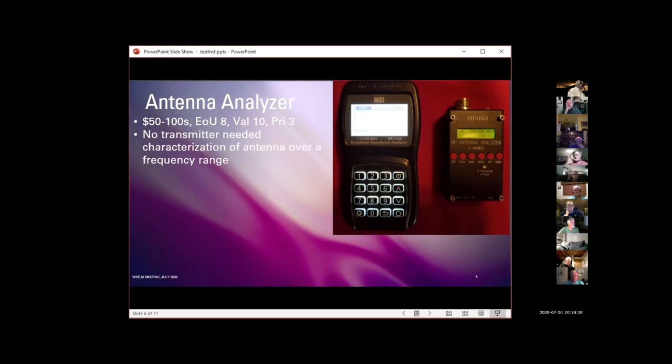So if you've tuned even a VHF antenna very precisely for the Pikes Peak repeater frequency, and you sweep the 2-meter band, you're going to find that antenna actually isn't working nearly as well at the top end or the bottom end of the band. These things make it very easy to graph a particular frequency band. And even though I really like VNAs, these are substantially easier to use, and that's why I have the priority on them that I do.